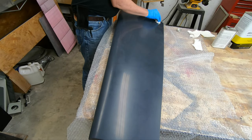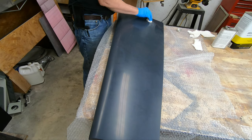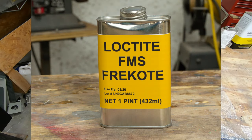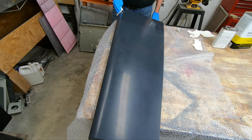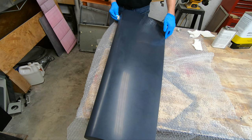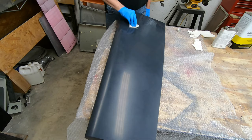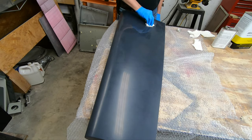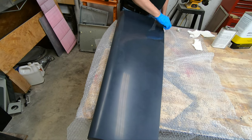Here's the rudder plug — you probably saw in previous videos where we had made this plug and sanded and polished it. This plug already had three coats of Freecoat sealer on it. Now it's time to put some release agent on it. I have some really old Freecoat 700 NC release agent — by really old I mean I've had it for two years and it's supposed to have a nine-month shelf life, so it's a little bit past its shelf life.